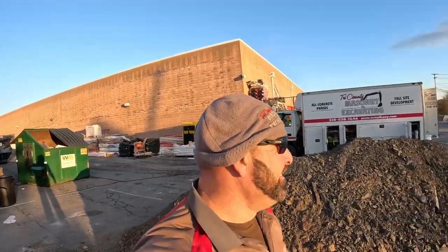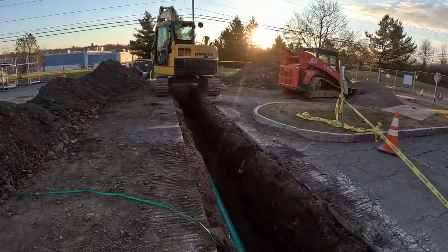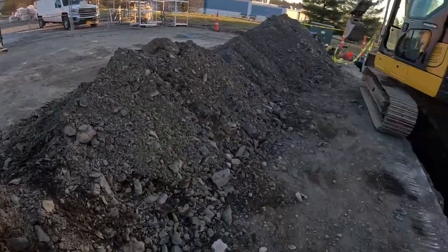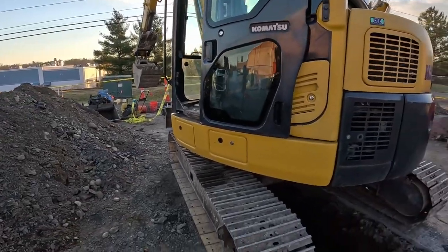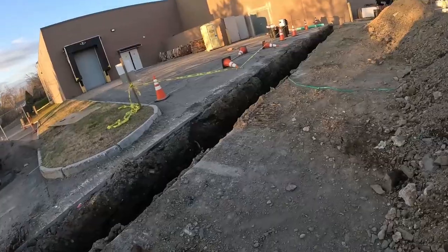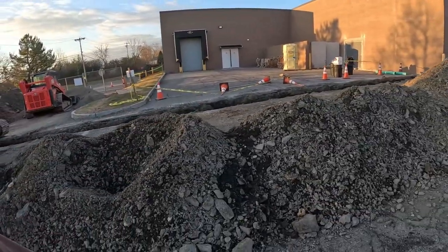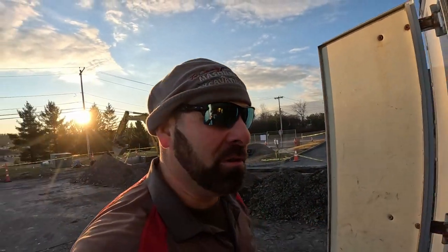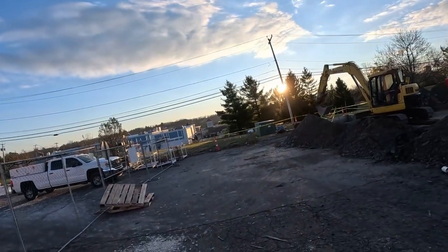Back on site. Got Crazy Carl today. Everything stayed good, no cave-ins. A little warmer today, so the piles are thawed out, be perfect, we'll come up in lifts. We got the diesel equipment, plate tamper for the hoe, and a regular plate tamper to jiggle jiggle the pea stone. Crazy Ollie just told us the truck's coming tomorrow, 6 a.m., to put out 3,300 boxes when it was supposed to come Friday, but because of the holiday, they're coming early. We shut the road down regardless. Is what it is. We're gonna do our best to get that truck in.